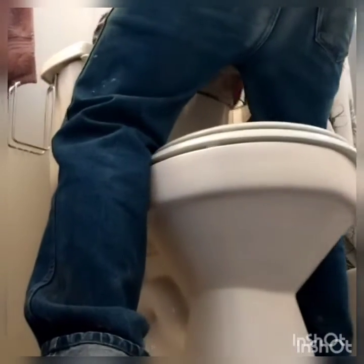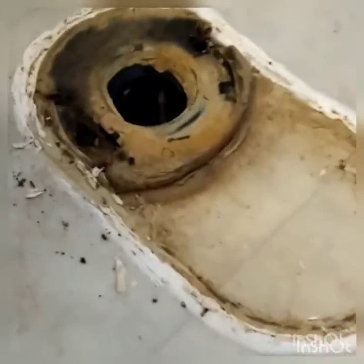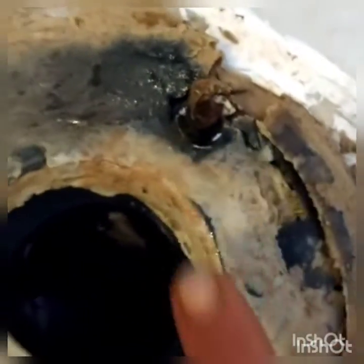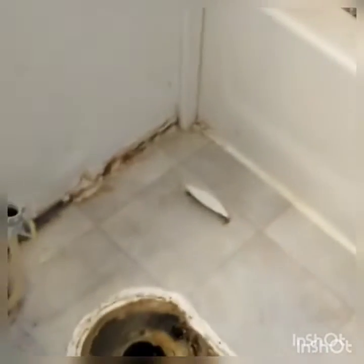It's stuck on that. Now what are we looking at? Let's see if the floor is collapsed. Underneath there it dips down a good three-quarters of an inch, with the wax ring potentially leaking there from where all the old cluster stuff is. So all I need to do is cut the linoleum out, see what the floor looks like underneath, because it's pretty rotten here.